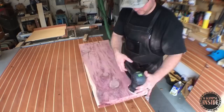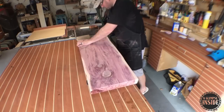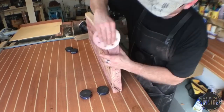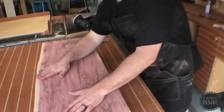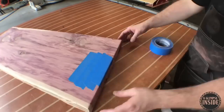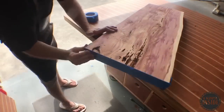Now this still has some mill marks on it, so what I'm going to do is run from 40 grit all the way up to 120 to 220. At the end of this process with the random orbit sander, I'm going to take that sanding pad and just hand sand the edges to break them and make the piece a little more comfortable. You've probably noticed by now that this piece has quite a few voids and knots in it, so now it's time to prep this for some epoxy.